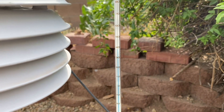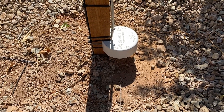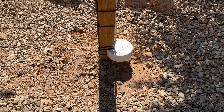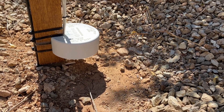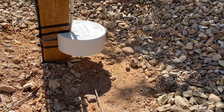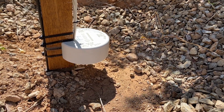It should just be under 40 degrees Celsius. It's July 15th, 9:35 a.m., and I went ahead and put this PVC cap over those two temperature sensors that are just above ground and at ground, just to provide a little bit of shade and hopefully get a more representative sample. I want to be measuring ground and air temperature, not the temperature of the casing holding the sensor. With the sun beating down on that metal casing, the results probably aren't representative of what I'm after. Hopefully this will create a little bit of shade so the sensors aren't being heated by the sun directly.